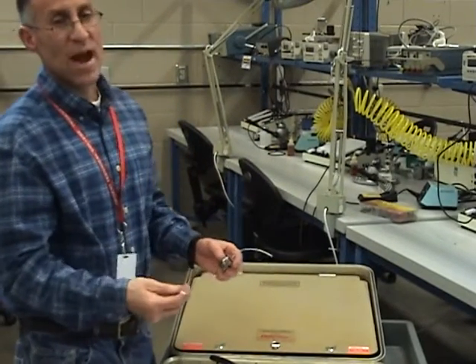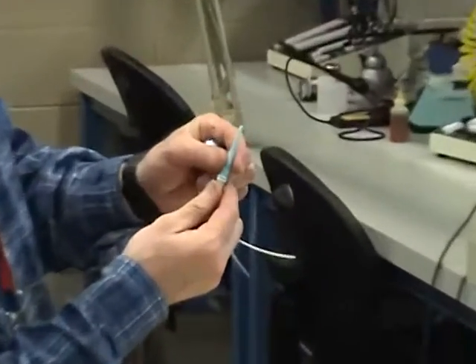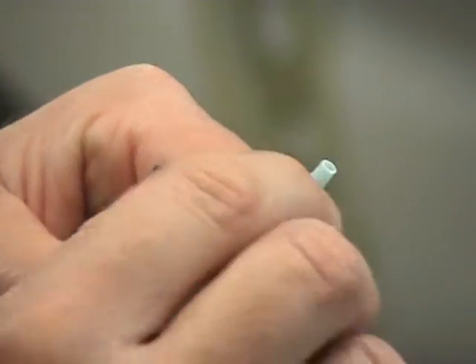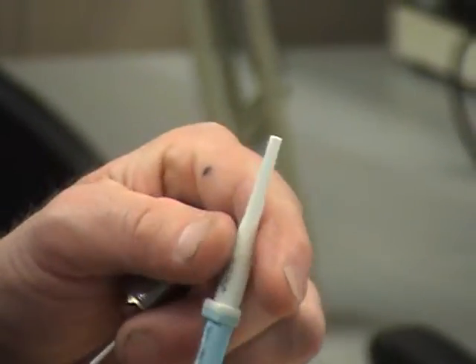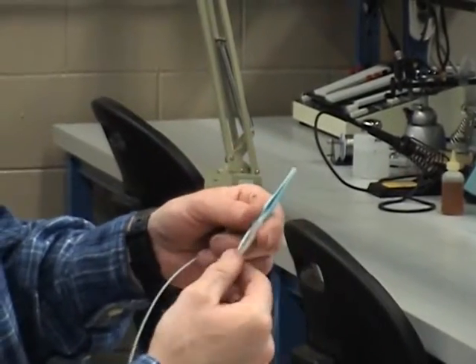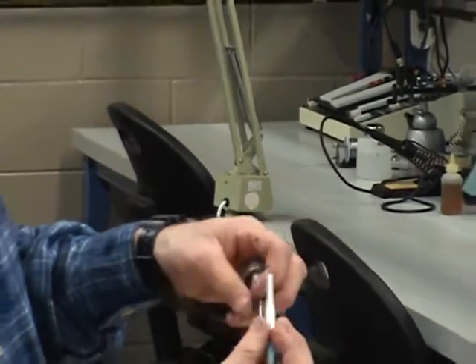Now I want to extract it. When I inserted it, this little tip — you'll see a little ledge. That ledge allowed this thing to insert and then pull out of the lock without releasing it. You'll see a little indentation on insertion tools. On the extraction tool you'll see nothing more than just the end of the tool itself. In a pinch, if I didn't have enough extractions, I cut off that lip and it will work as an extraction tip.